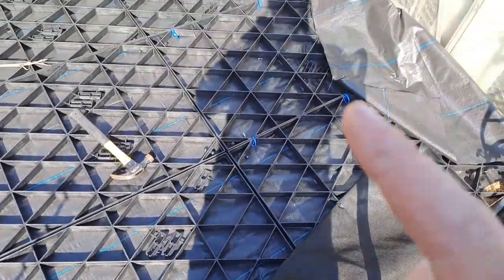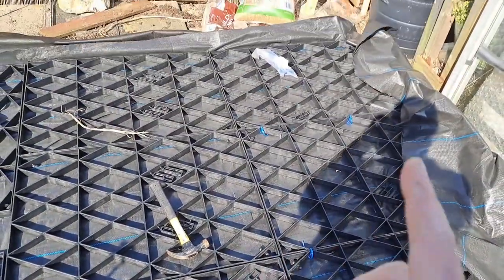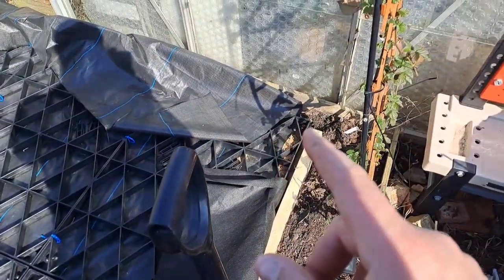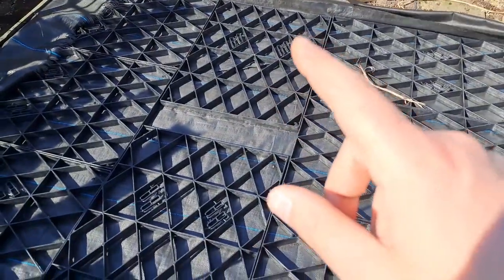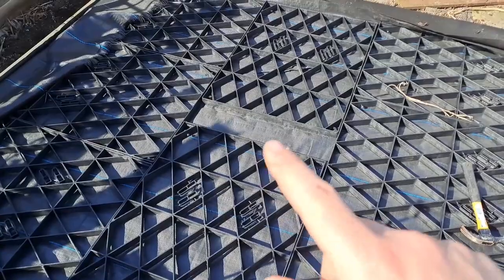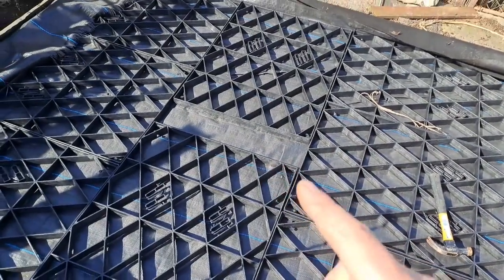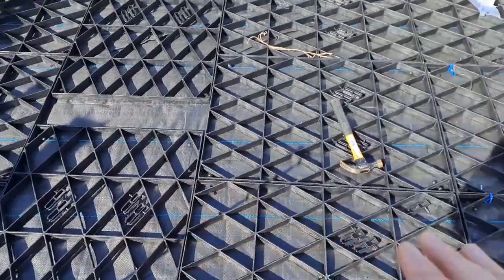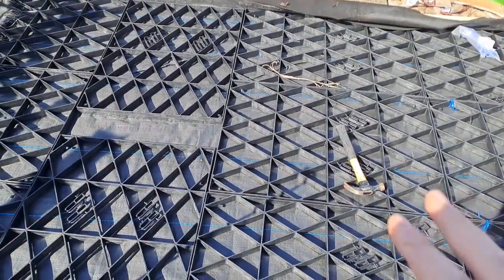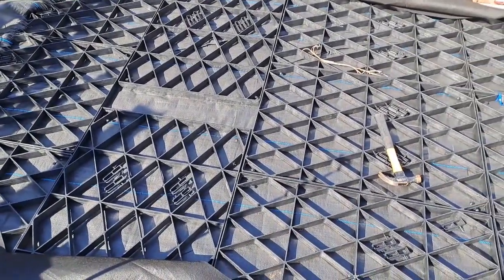So this is the eco deck laid out — you can see I've started putting some cable ties in. I didn't realise just how much bigger this was than 10 feet by 6 feet, and it doesn't fit in my frame so I've knocked that side out, which takes it back a bit further. I've got another three slabs — rather than laying them in the correct orientation I'm going to lay them this way, and that section will just get filled with gravel. The office has got bearers that go all the way across so that shouldn't cause any issues. I need to get it all cable tied and secured, then I'm picking up one of my kids from school, and when I come back I'll fill it all with gravel, get it level — jobs are good.